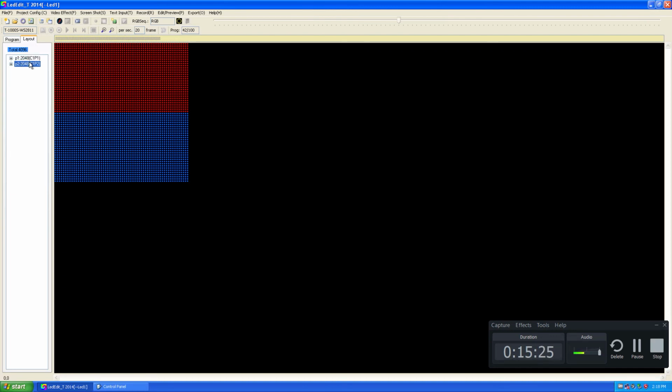Each port in this case means a new pixel LED controller. This one separately connects to one pixel LED controller, and this one connects to the other pixel LED controller. There's no connection between these two pixel LED strings, but there's the connection between the controllers. So you don't have to connect these two groups of pixel LED strings. This whole thing works as one unit without having to worry about that.